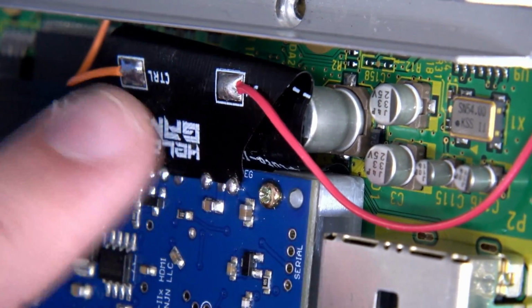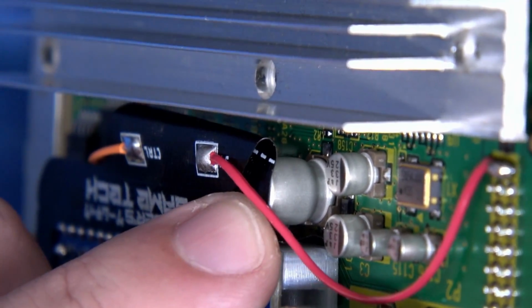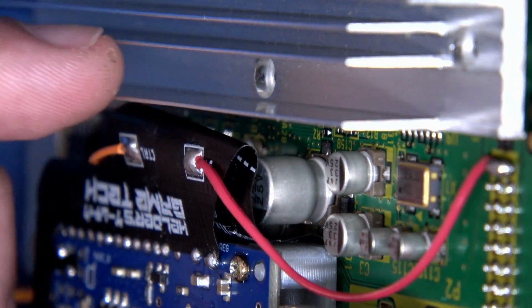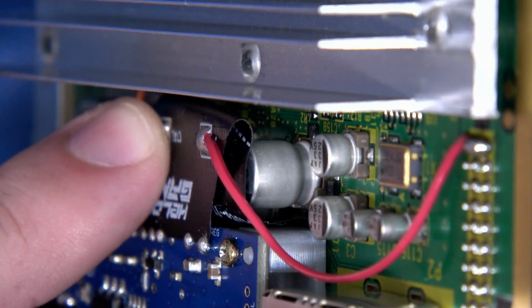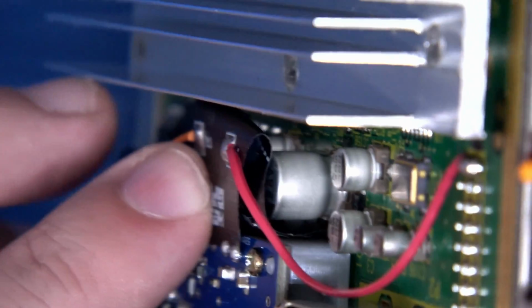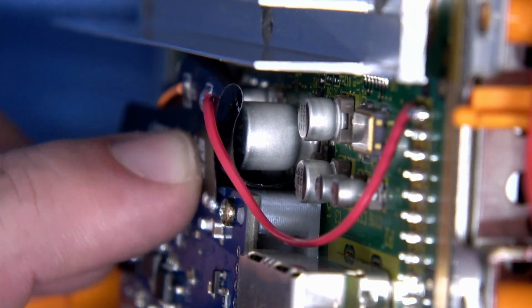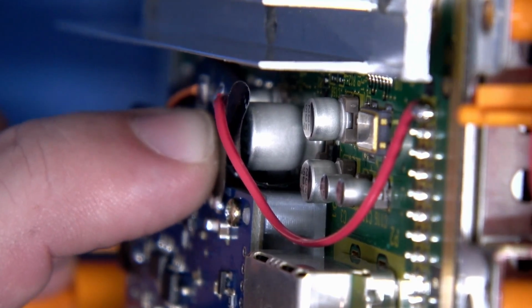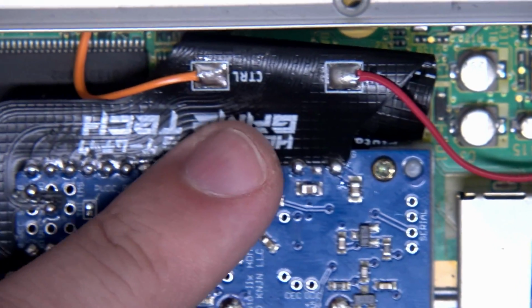The problem is our ribbon cable here must be folded two different times, and that folding creates this springing effect where the capacitors underneath the ribbon cable are always pulling up or forward, just like this. Up, up, up, always. I can hold the board flat and make sure that ribbon cable is perfectly parallel to the Pluto. It doesn't matter. There's always going to be forces pulling it forward just like that, like a spring. This is fatiguing our solder joints.